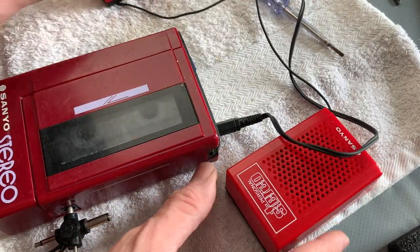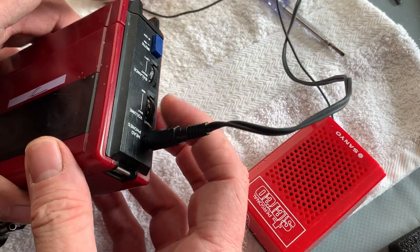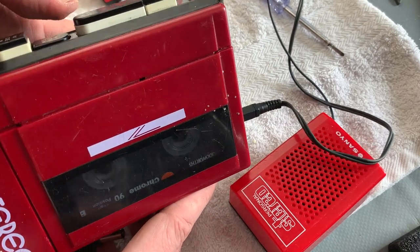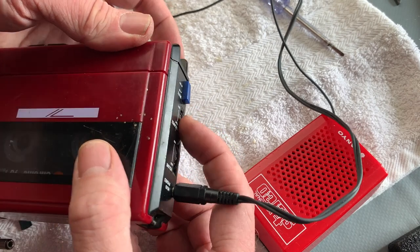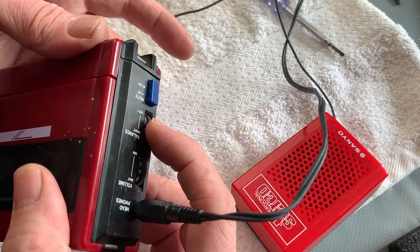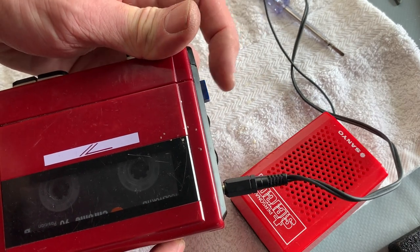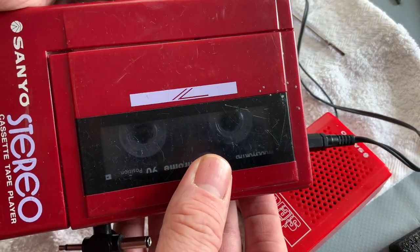Okay so I've got my trusty old JSX-37 speakers - I've put a tape in, let's try it out. Good stuff - that's working, the volume pot isn't crackly, rewind is working nicely, stop, play, and balance - working beautifully. Right, let's try the mute. There we go - that's spot on. It doesn't completely kill it, it only attenuates it, which is what it's supposed to do. Let go and there it is. Rewind, fast-forward - all good.